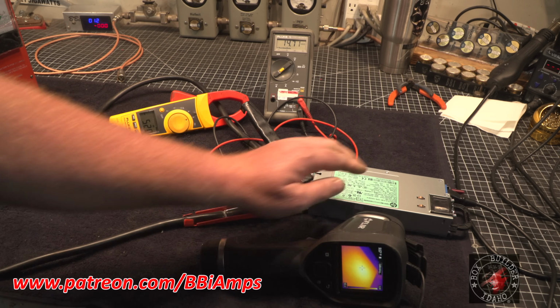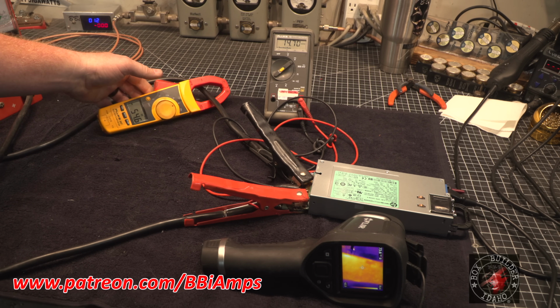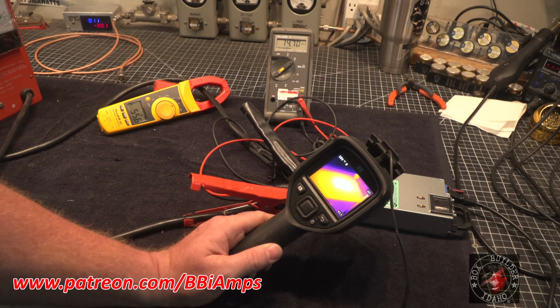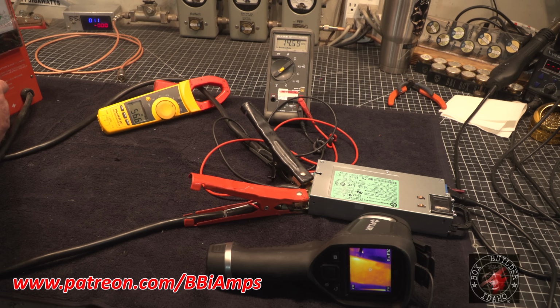We're starting to lose temperature out of the power supply at a 50 amp load. So we'll say conservatively that this power supply is rated for 50 amps continuous, 80 amp surge, right? Because with the fan running at full chooch, with around a 50 to 60 amp load, and we're not at crazy super fast mode, you're still dropping in temp. There's a whole other gear we can take this to. Let's go ahead, we'll bring that load back on up some more. We'll float it up around 70.